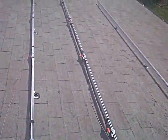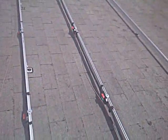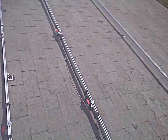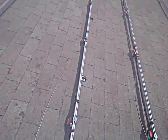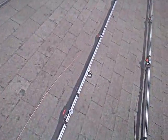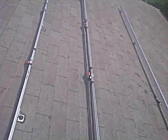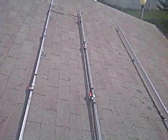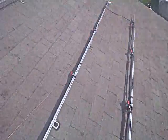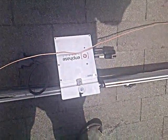Monday we're going to set the panels. We've got 12 panels going up here. We'll set the inverters first, set the panels, plug in the panels, and bolt them down. All the electrical's done. If you guys are using the Chinese grid-tied inverters, I'll show you downstairs how to do the electrical for them if you don't want to use these. I would definitely recommend that if you're going to do solar, you use the Enphase ones. If you're going to do wind and you want to use Chinese inverters, that's fine because there's really no inverters for wind right now for low voltage — like 60 volts or 12 volt. The Sun G works real good; that's what I use for wind. But I do use the microinverters Enphase for solar.